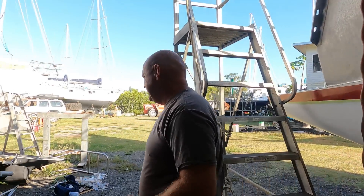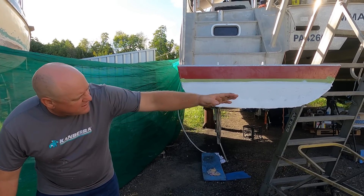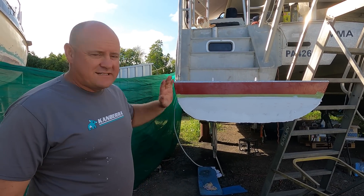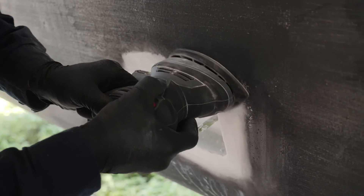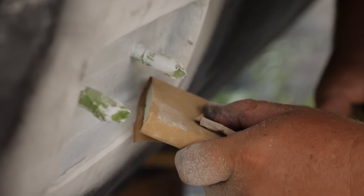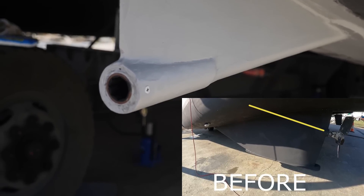At the back here - none of this is sanded yet - but we're making a nice hard edge to get a clean release. The camber hasn't come out quite as much and it's leveled off slightly at the back here. Then we'll sand this and make a nice hard edge for a clean release of the water. The next step is to sand it, then epoxy seal it, and once that dries we'll do the tie coat and antifoul the lot. And then we'll see you next time.